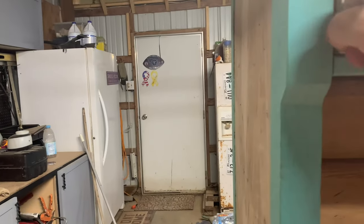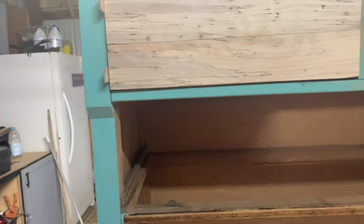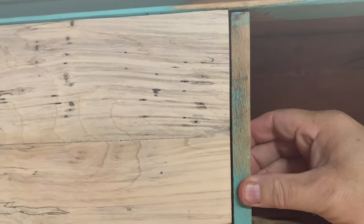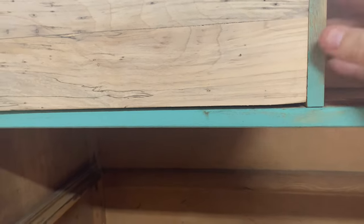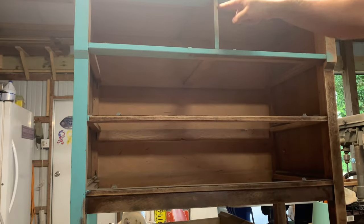What I've learned is to use outside shims that are exactly the same width — these four pieces right here are the same width, then we can deal with the middle. This one has presented a little bigger challenge, but we're going to remove that little dovetail on the bottom — it's too complicated to get in and out while that's on there. As we see, that gap looks really good. We have two straight edges, so all we have to do is check the edge on the other one. If it's relatively straight, we can just adjust the width and we'll be good.